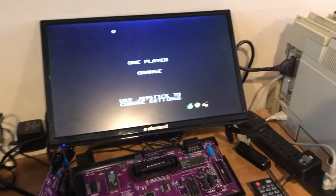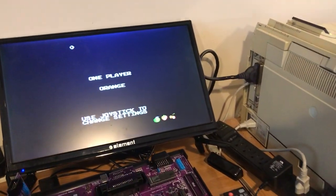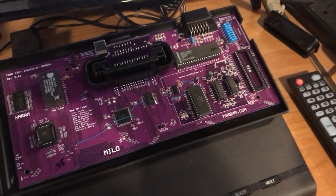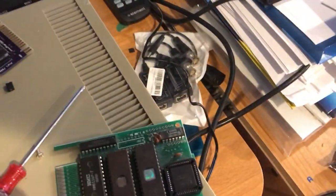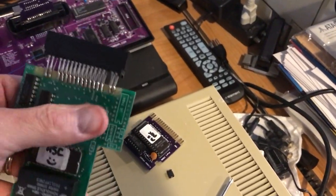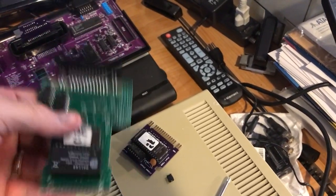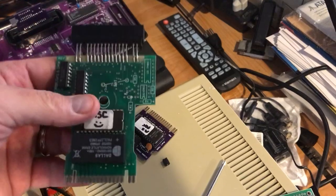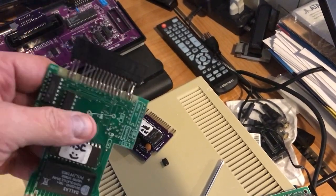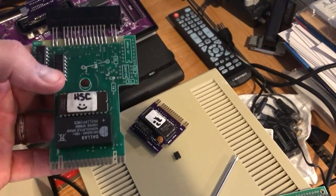One of the things I'm talking with Mark and Perry about is seeing if we can jump. You have to understand, let me explain a couple things here. The high score cartridge, the original individual high score cartridges, these are the ones. Well, this is the NVRAM modified one that I made. I basically took the old original GCC design that I had originally done in 1999. I based these high score cartridges to a T, exactly the same schematic as the original GCC schematic. The problem is that it actually had a battery drain flaw in it.